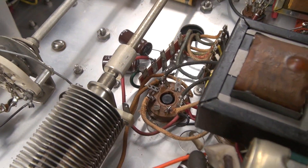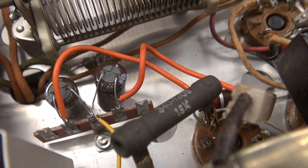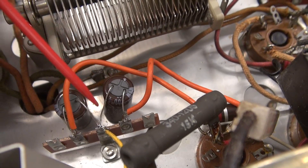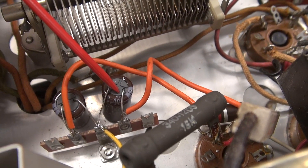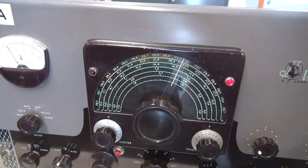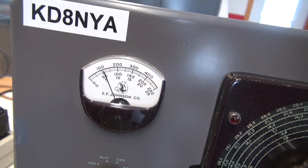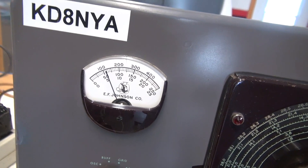See if we can adjust that modulator bias. Very important note: make sure on your negative bias tube caps that you put those positive lines to ground — don't flip those or you're going to have a disaster on your hands. Get my screwdriver on that modulator adjust, and you can see I can adjust her just like it's supposed to, so we'll set it at about 60 milliamps.